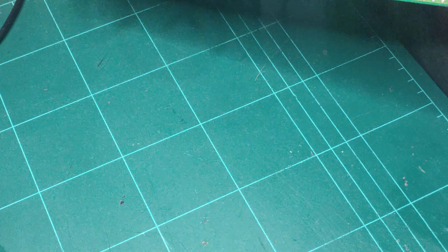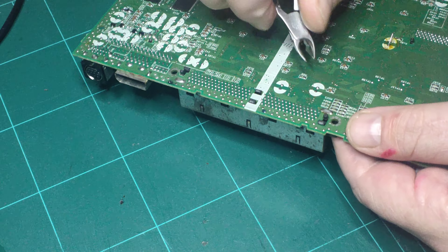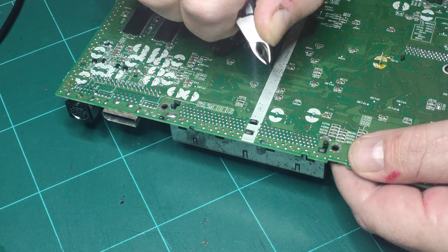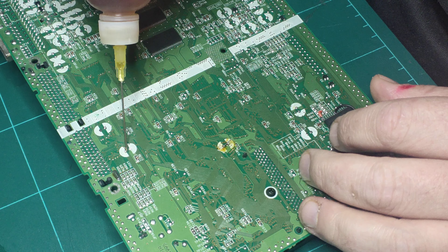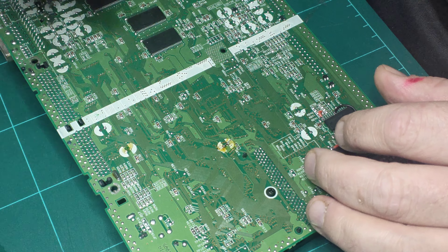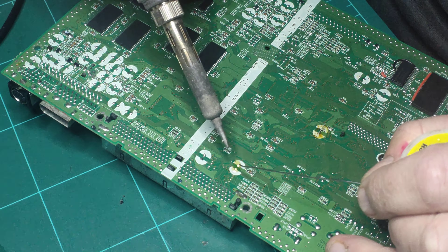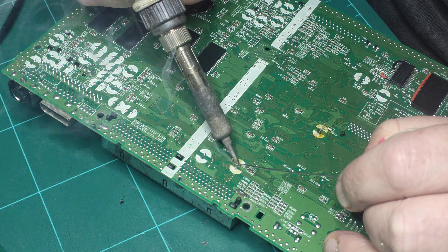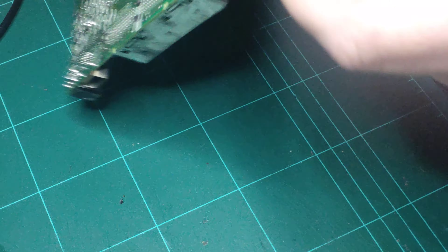That's perfect. There are the two holes just there. That's a 100 microfarad 6.3 volt cap. I'll handily mark that once I get my cap clips from Console5 — I just go for it and mark what they are on the bottom of the dispensing tab, just so it's easier and you don't have to do the double-checking every time, and then you can move along a bit faster. Now I'm just going to find the positive point on that cap.